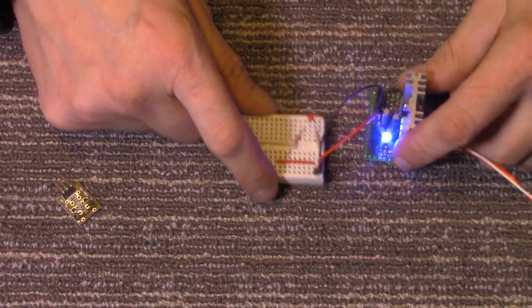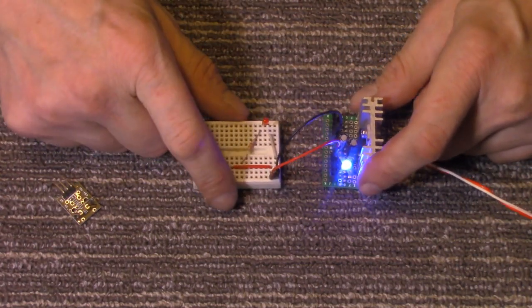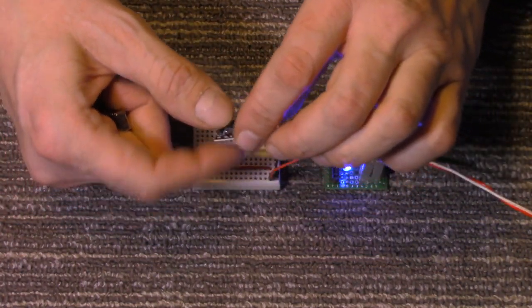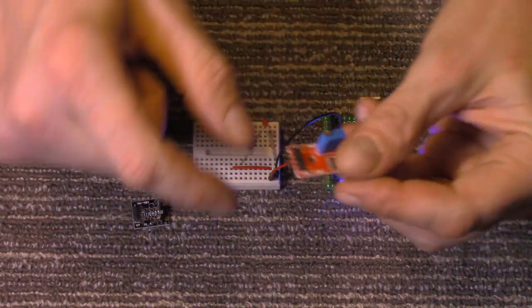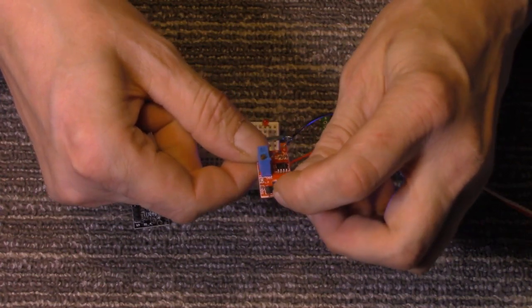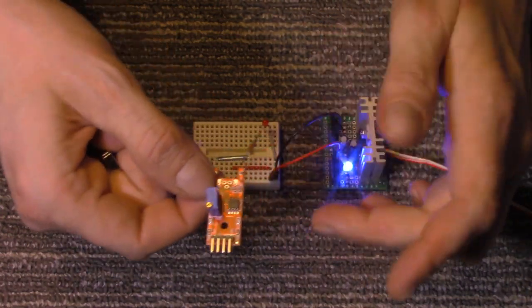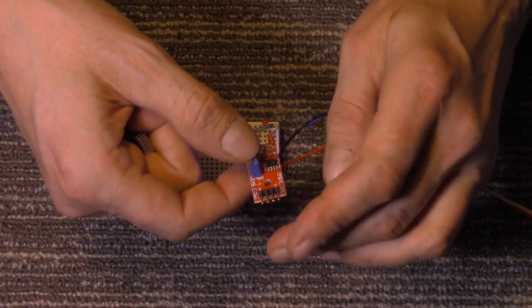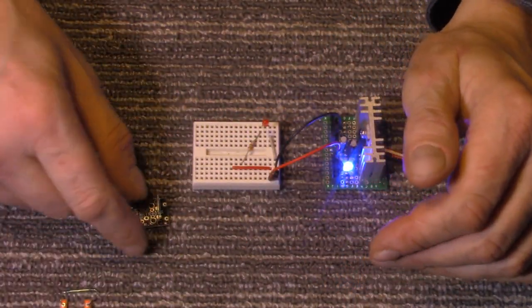To demonstrate the other one, I'm not going to use the Arduino. I'm just going to put it on this little breadboard here. I've got my 5-volt power supply. But you just connect this one to Arduino. There's a positive and ground pin on this sensor, and it's right here. This is digital, this is positive, this is ground, and this is analog. I don't know why they really put this on here, except for the digital thing. Like I was saying, you could use this as a standalone to trigger an alarm without using it in Arduino. That's about the only benefit to this.